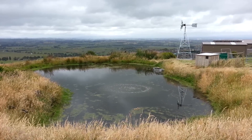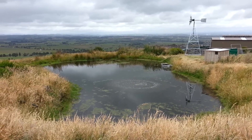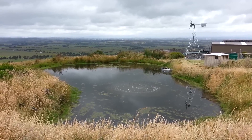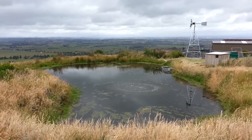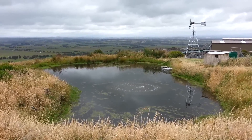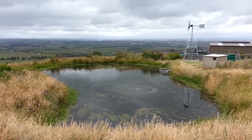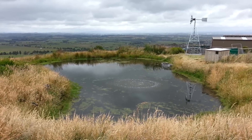You can see the wind here is enough to get those blades spinning straight away, which is great. The principle of these systems is that behind that windmill head sits a compressor, and similar to a little aquarium diaphragm pump — just on a much larger scale — as the blades spin around, the compressor diaphragm pumps air.